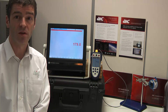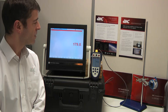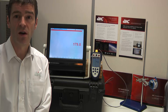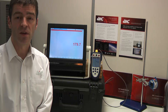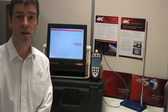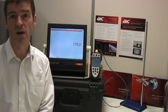So, how can we calibrate this thermocouple cable and assure ourselves that it's not introducing sources of error in our measurement and control? Well, ASTM, British and other thermocouple standards all state that standard techniques for calibrating thermocouple cable are only applicable when the cable is new. If you want to remove the cable to calibrate it, you have to be very confident that you can exactly recreate the temperature gradients that the cable will experience in practice. Otherwise, the inhomogeneity in one part of the cable that experiences an error in practice may not introduce an error during your calibration.